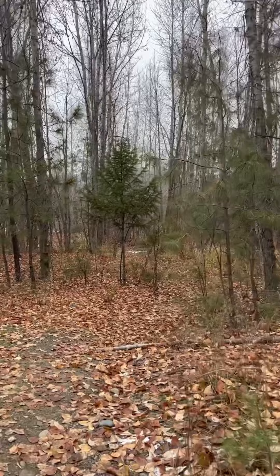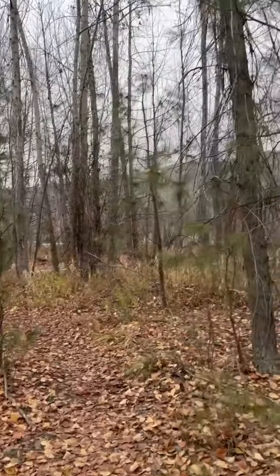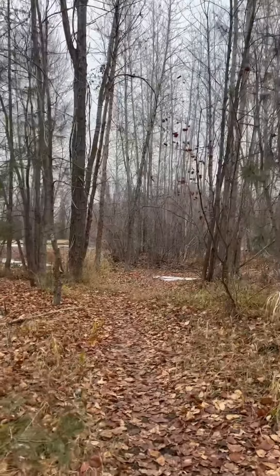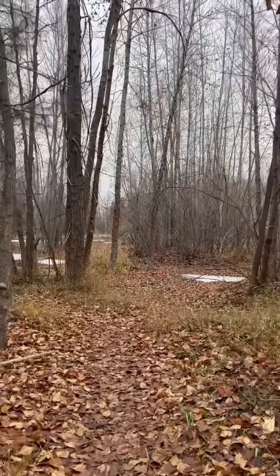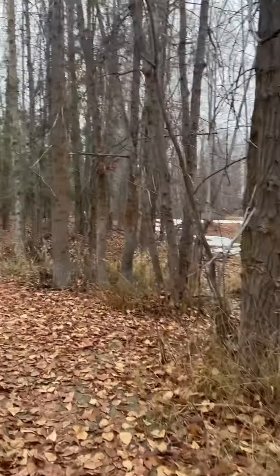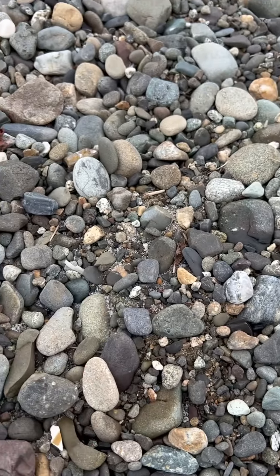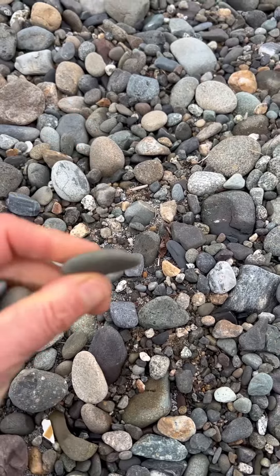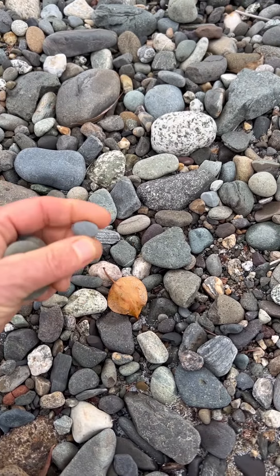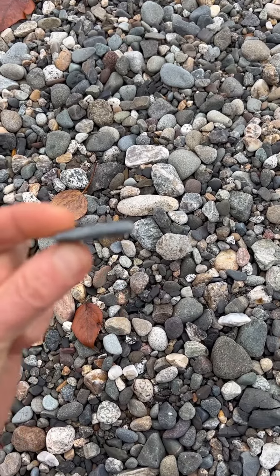I love taking walks to the river in the fall when the river is lower and more rocks are accessible. If you don't have access to a beach or river, you do have other options such as getting bags of rocks from a garden store or one-by-one-foot rock tiles from a hardware store. If gathering your own rocks, you're going to want them to be consistently thin. They don't have to be the same size, but they should all be relatively thin. That's most important if installing on the floor, in which case the one-by-one-foot rock tiles might be a better way to go, albeit more expensive. Wash the rocks with mild soap and water.